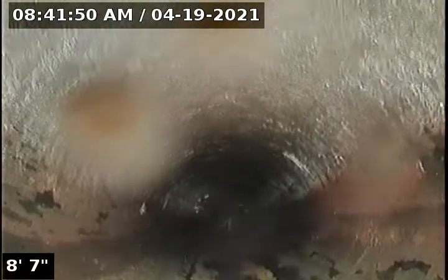There's a three-inch ABS clean out, so we'll be accessing the line for inspection. I have water running from the kitchen sink as you can see. The head of my camera is facing downstream towards the main. The purpose of this inspection is to determine the overall condition and serviceability of the sewer lateral for this property to the city main. I'm going to go ahead and begin here.